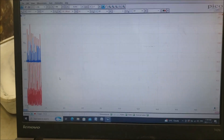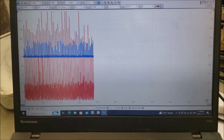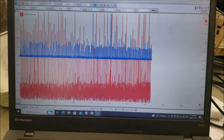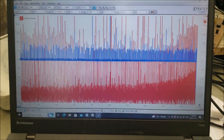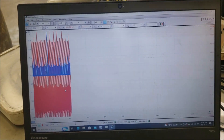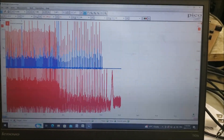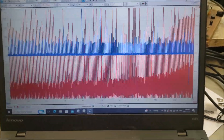Okay, slowly increase the RPM. Let it go, then go back down again. Right now it's pretty much evident what we have — it is confirmed that it is a plugged exhaust.